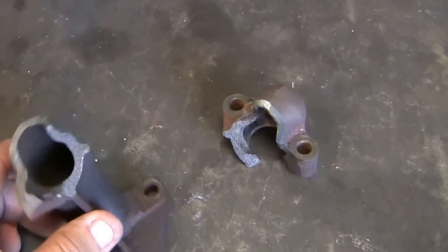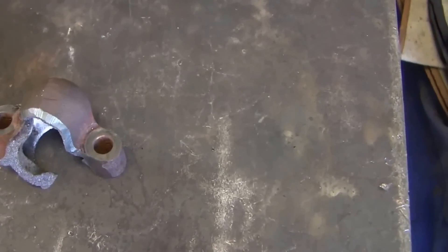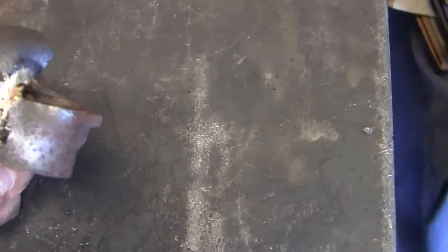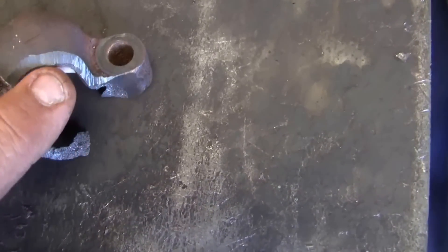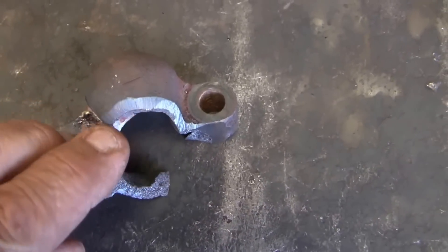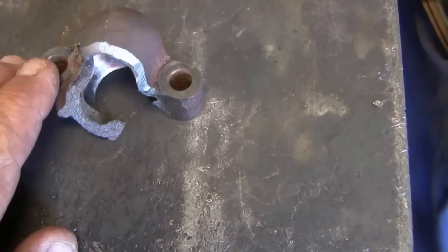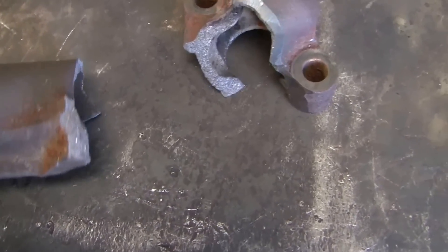They do still have the part available, but I told him to let me give it a try. I've had some luck with brazing cast iron — a lot of people think it can't be done or shouldn't be done. This was in three pieces when he brought it to me. I've brazed up one piece and basically when you're done it has a color different from the cast iron, but I've ground away some material from the outside enough to fill it in. The brass is actually very durable and hard, and I've had luck with this on exhaust manifolds and other cast iron items, so I'm going to give this a shot. If it works I save him money and learn a little more about brazing brass.